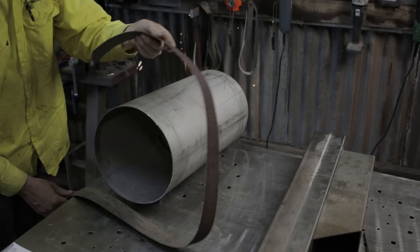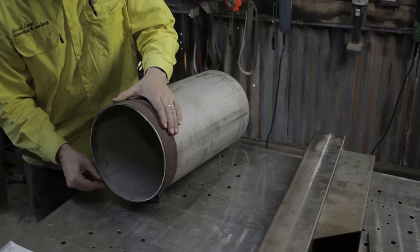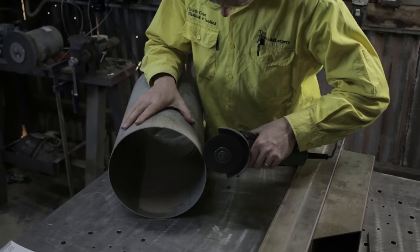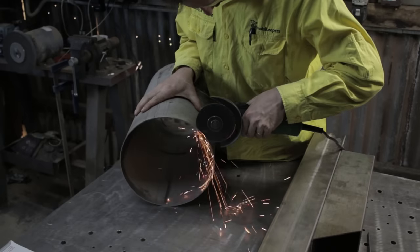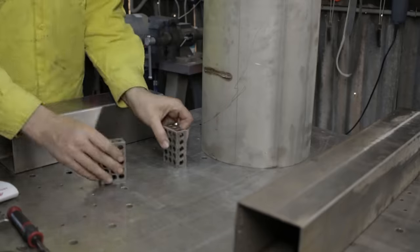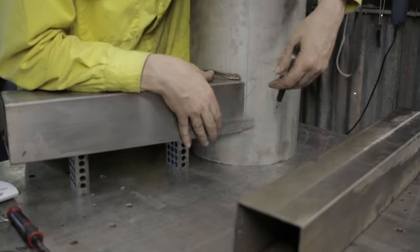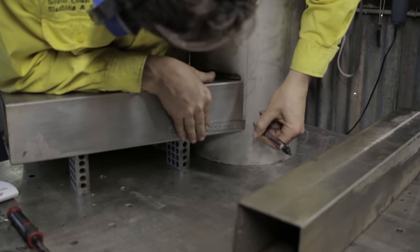This rather large and ugly bit of stainless steel tube is 250mm in diameter. It's not exactly the straightest cut on the end, so I'm using an old grinding belt as a wrap-around straight edge — it's not the right tool, but it's better than nothing. The overall length of the pipe is 480mm long, and as you can see I'm notching in the fire tube a little bit high so there's room for insulation at the bottom.